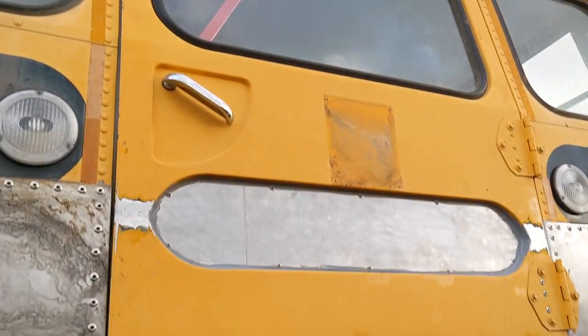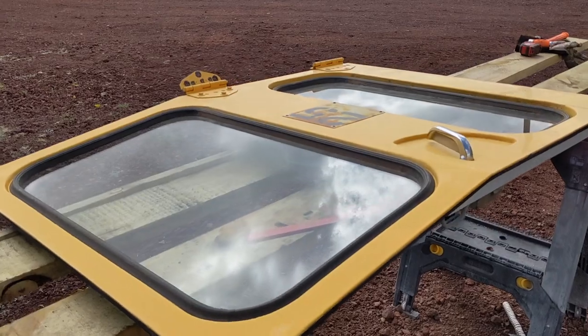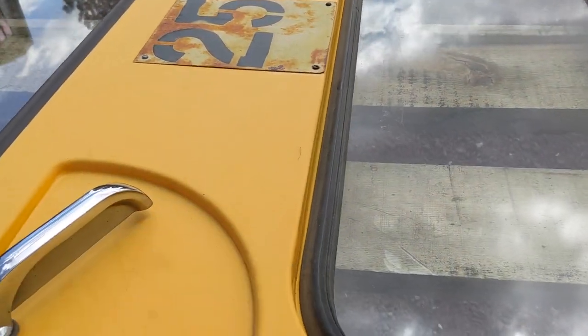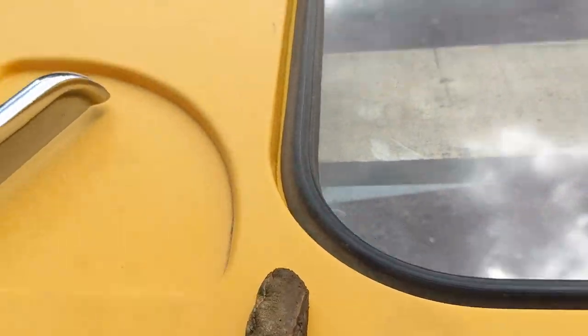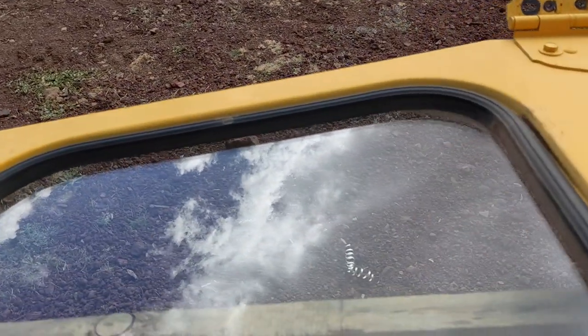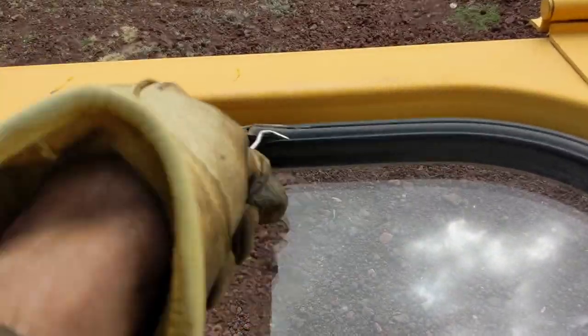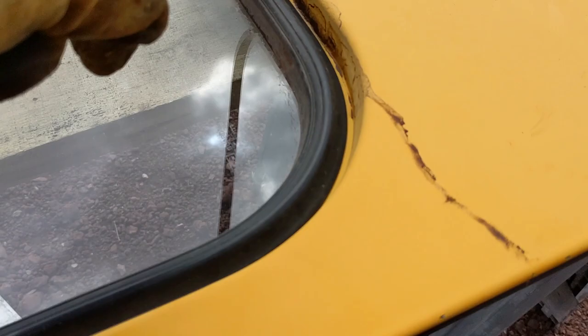In today's video I just wanted to show how I shortened the door and made this change. The first step is figuring out where I want the cuts to occur and then taking out the glass — I'm going to cut here and here. I've got to remove that lower pane of glass, so the first thing is to pull out the locking strip using a pick, grab that and pull it out all the way around. It comes out pretty easily usually.